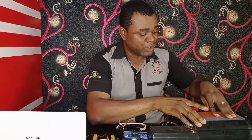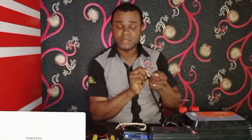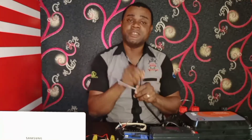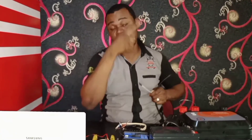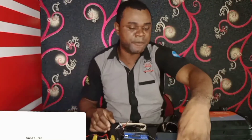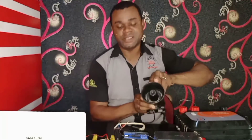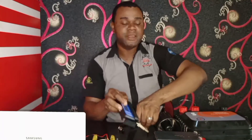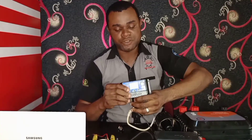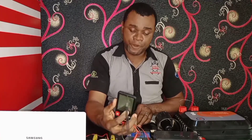Now let me take you through all that we have today. We will be connecting the system to the solar panel. I already have here with me a source cable from my solar panel — here you have the positive and the negative. My solar panel is outside but I can bring that here. Then we have our batteries here, a 7Ah 12-volt battery, and we have our siren here. We have our solar panel charge controller here, which we need to use for this. You can also have your meter just to confirm every connection before putting them to test.